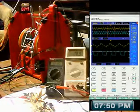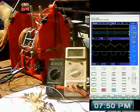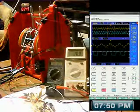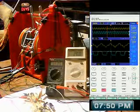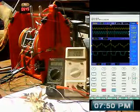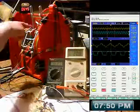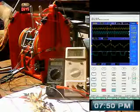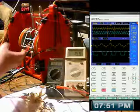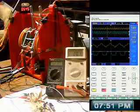Alright, that's it for now, because I'm going to have to start drawing the circuit up, it's very basic. I'll probably put a few extra pads in, so I can add some trimmers at some point to play around with it. It'd be so nice to get some circuit boards etched so I don't have jumper leads all over the place, and I can make a circuit board that will mount directly on the coils, and it will be a lot less messy. Then I can solder the coils directly onto the circuit board, and I won't have the problem with the jumper leads slipping off the wires, you know what I mean? It'll be a lot better than when I do that.